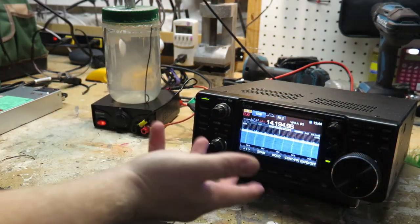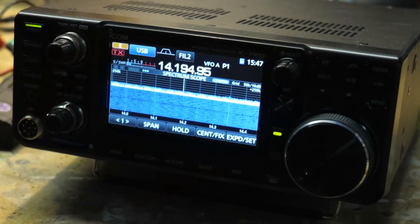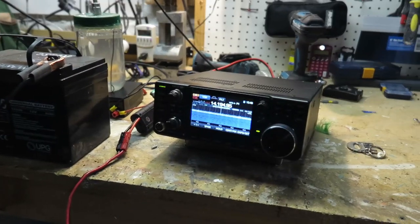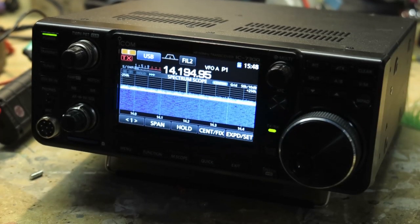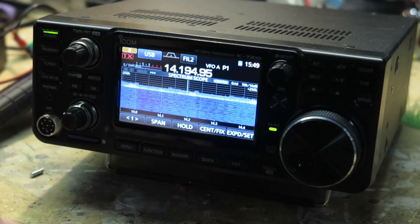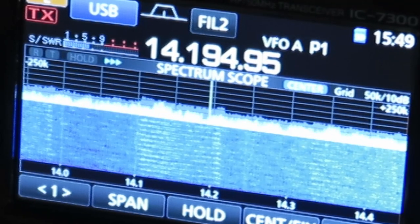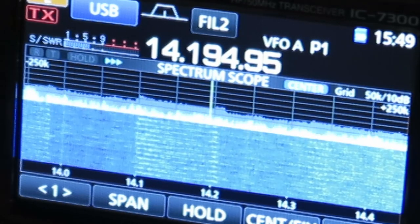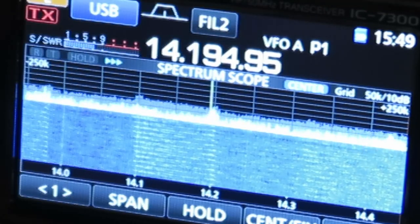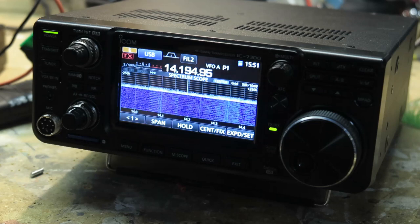I'll run through the various bands to see what the noise floor looks like. That was the Radio Shack power supply. Here is what a battery looks like — all of those combs are gone because I'm plugged into an actual battery. I still notice quite a bit of RFI, but that's probably because of my house. Here is the new HP server-grade power supply. There's some unusual wideband hash on a particular frequency, but it wasn't nearly as annoying as the comb from the Radio Shack supply.